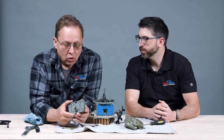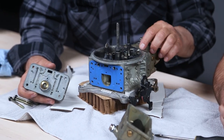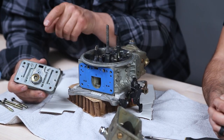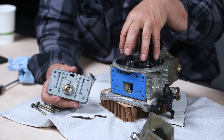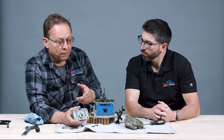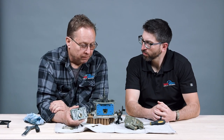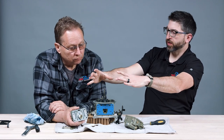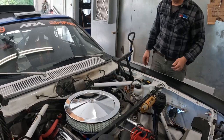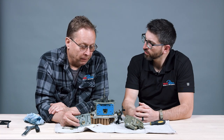How would those passages get dirty? The air filter sucks all air in the top, but if the air filter leaks or the gasket leaks — or in our situation we're racing on dirt roads — little specks of dirt can get down in there. Dirt can get around the air filter, or if your fuel filter isn't very good. I've seen people change the fuel line or carburetor and get dirt in the system. The air filter is vital to keep dirt out of these tiny passages.